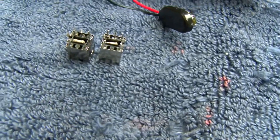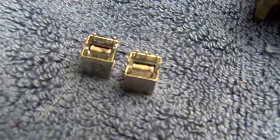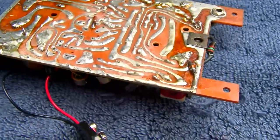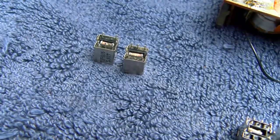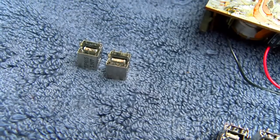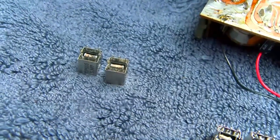And if these fix it, if we get a defined peak with these, then I will go back and scrape those capacitors out of there, try to center those controls out, and go with variable capacitors to find the value. I was looking on Mouser, and they actually had some of these. And in the spec sheet, it says 180 picofarad. I don't know what that's a reference to. You have to go back and look at the other one that I worked on. And I think it was around that, the yellow one that was bad. The radio just squealed and wouldn't do anything.